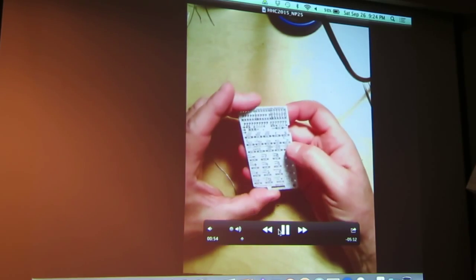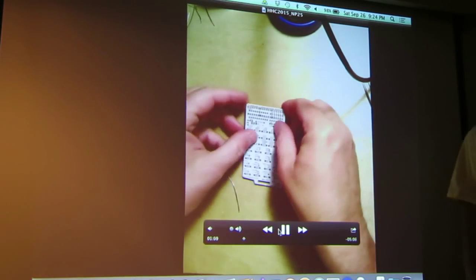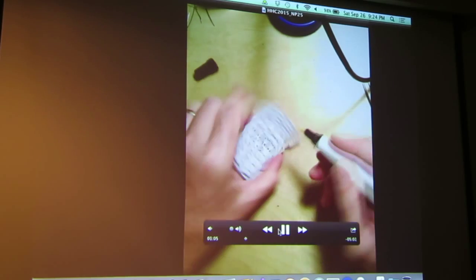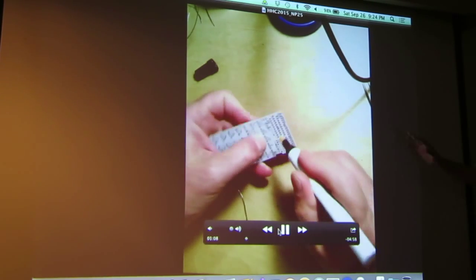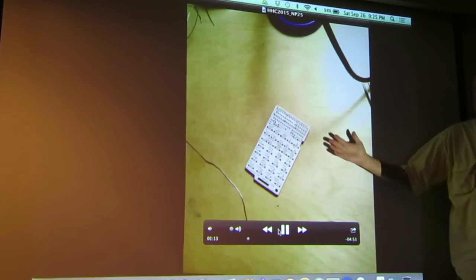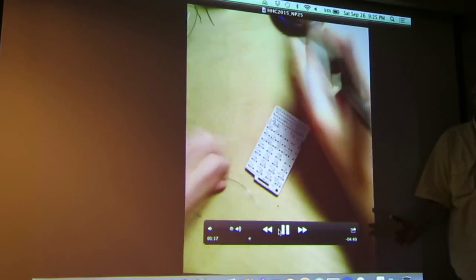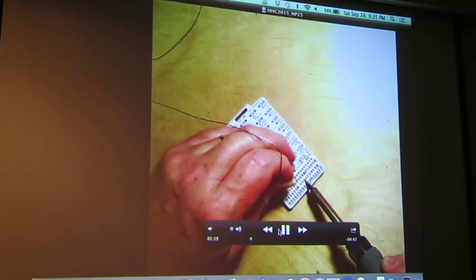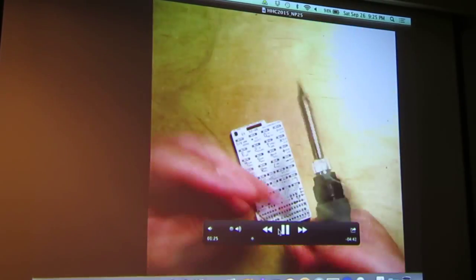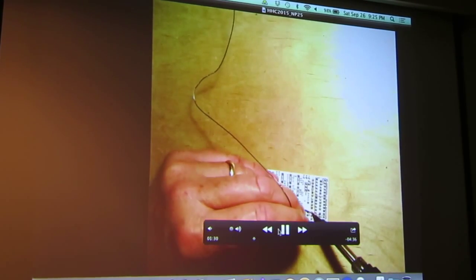Question: why do we see no traces on this circuit board? Because you have a solder mask over the top of it — and that's one of the services that you get. It makes it great for soldering. You can see I just used some flux. I've got a flux pen and it works great. I can't overemphasize the use of flux — don't solder without using flux. Flux is your friend. You will be in pain without flux.